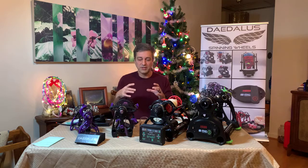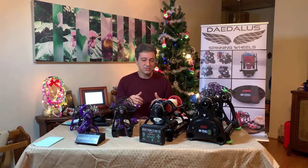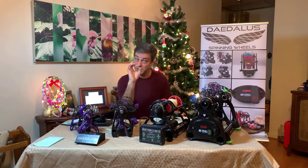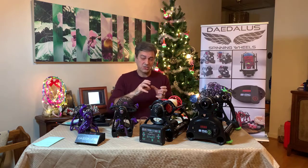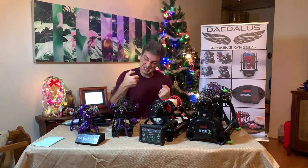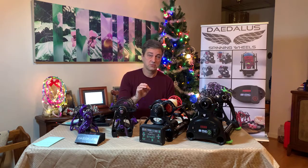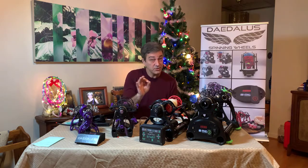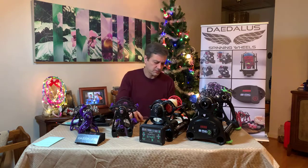There was a thing with the older Starlings. I had to use a rubber belt to squeeze carbon tubes around some leather that I was gluing. I used the same urethane that I use for these belts, and I made a little bitty belt about this big around, spliced. I would stretch that thing like a bow. It took all of my hand strength to get that belt around that unit. I used the same belt for hundreds of wheels, and it never broke, it never stretched. They're amazingly tough if you get that splice right. If the splice is not right, you're going to know real quick. So if it works for 2 weeks, it's going to last longer than I can imagine.